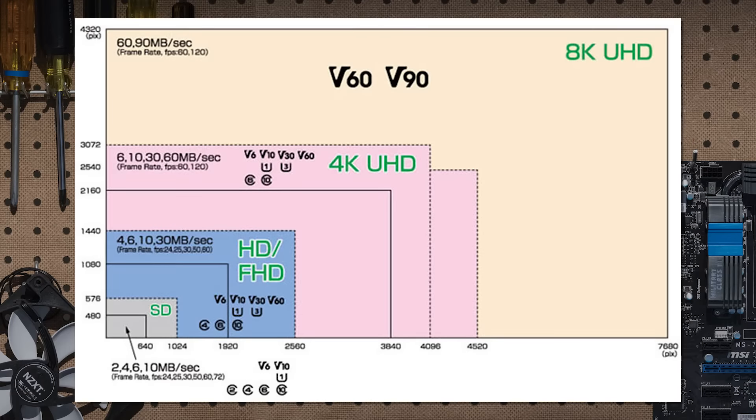But if you don't know that, Class 10 works for 1080p video at 30 frames a second. Generally Class 10 for 4K 30 and lower is good. If you're going higher than that, then you're going to want a V30 or V60. If you have an 8K drone or a drone doing surround video and recording multiple video streams and also GPS data, you're going to want the highest performance card — V90 probably, whatever they recommend. Generally 8K and up is V60 to V90 range.